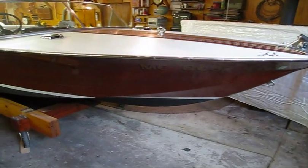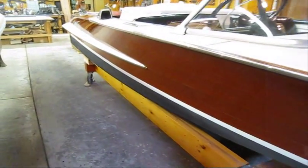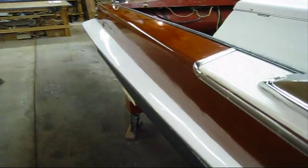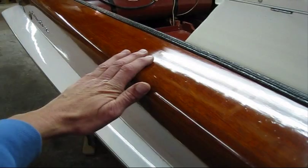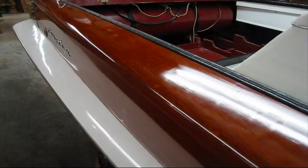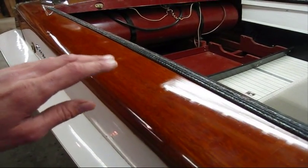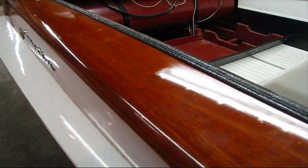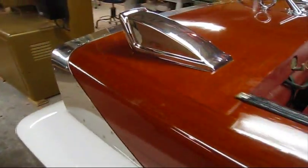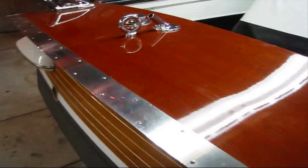One last thing I wanted to mention — when to varnish a boat like this. As far as I can see, it's best to varnish a boat when it's still in good shape like this. You really need to be on the offense when it comes to varnishing your boat. You don't want to wait until the sun deteriorates the varnish so much that it starts separating from the surface of the wood.